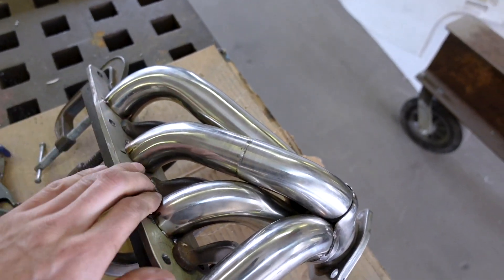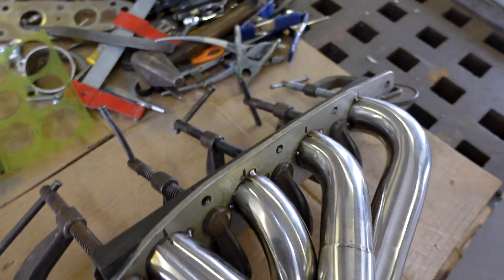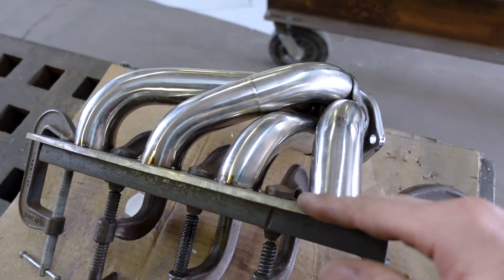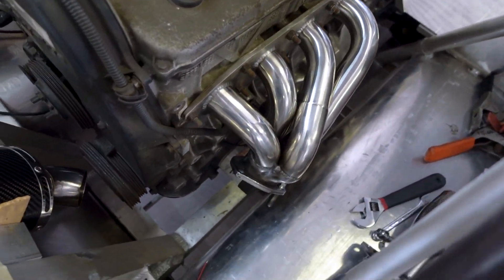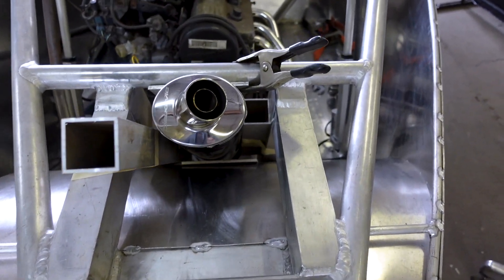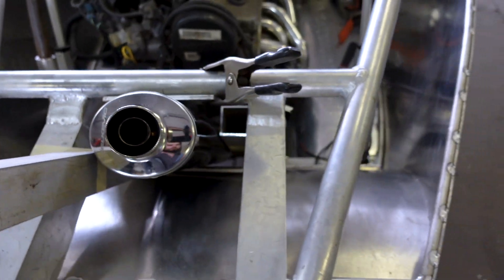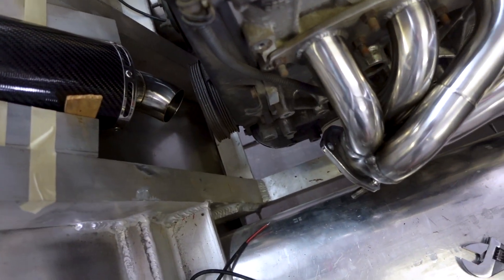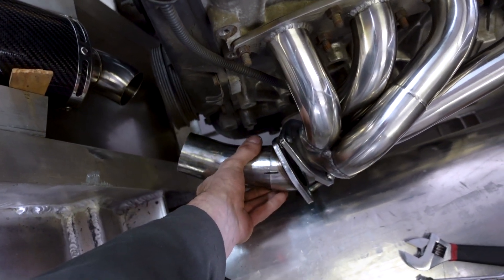Okay, I'm going to get ready to finish welding this thing — it's all locked in place. I'm clamping a big piece of steel back here to keep this flange from warping. Okay, so the header is on — got it all fully welded. Working on the muffler now. It's supposed to go the other way on the motorcycle, so I'm going to have to cut this tip off and straighten it, but that's minor. Going to get it run down through there — this is just the piping that connects them, running right through here.